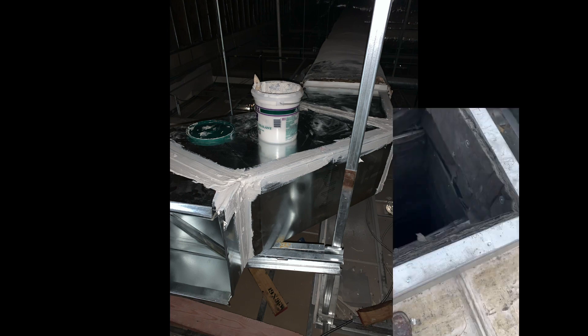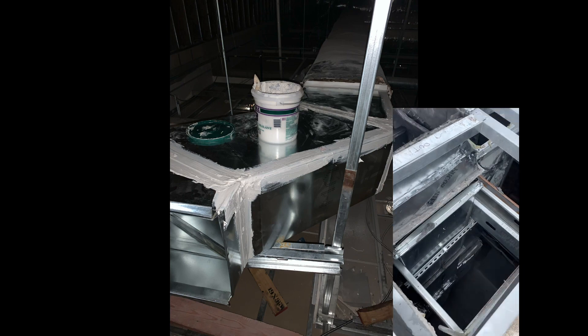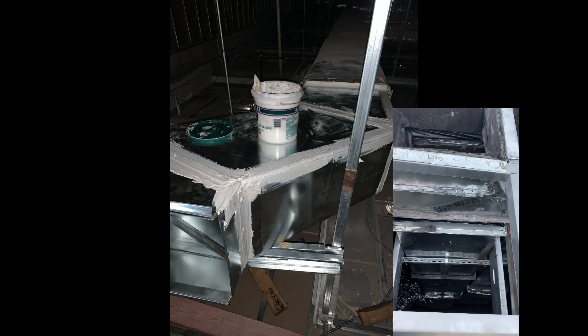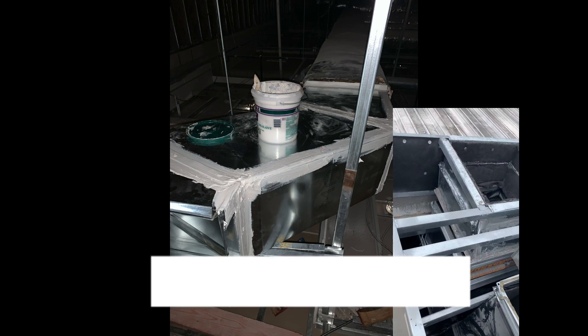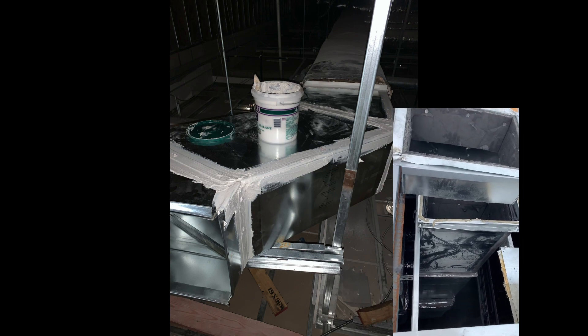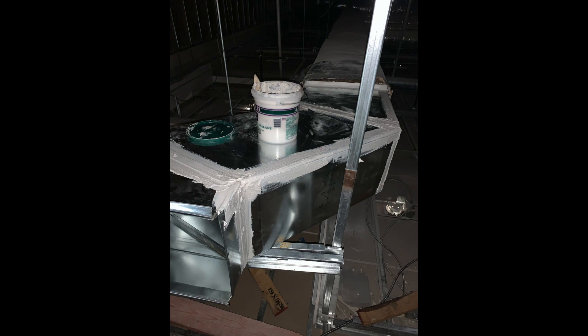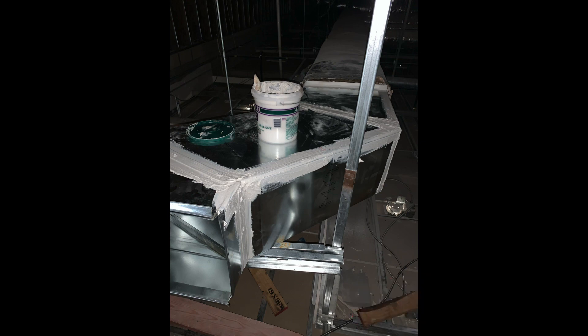Once we made the set, we went back up in the ceiling and connected it with two drives. The drives had to be an inch long on each side — so if it was 20 wide by 14 tall, the drives were 16 inches, the S-locks were 19 and a half. You put your S-locks on and then connect — how I connect, I connect one side at a time. It's faster, it's smoother. You really have to use your duct pullers that way. If you try to slide the connecting piece into the S's at the same time, it's going to give you a struggle and you'll need a third hand. So I just connect one side at a time, put my driver on, work it up with the hammer. Once I'm past my S-lock an inch, I fold it over. You fold both of them nice — you don't want your drives to be way long, that's why you only give it an inch, inch and a half if need be, and cut the excess if you use a longer drive. And that's how you make a connection.